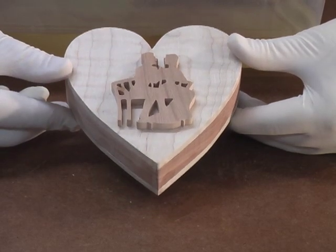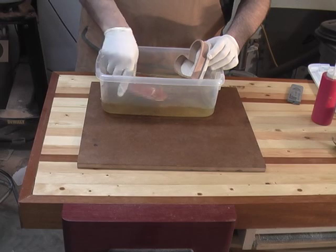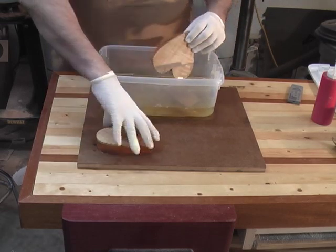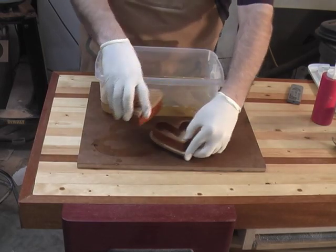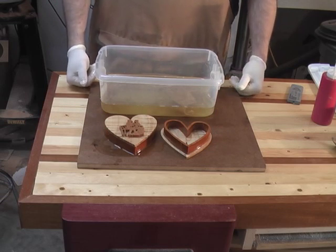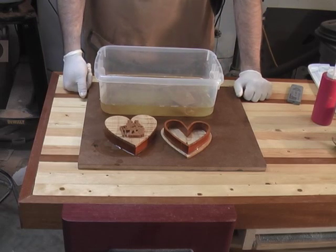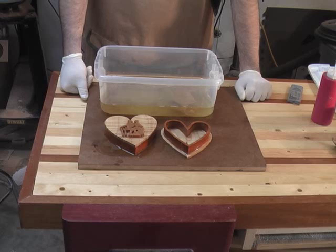Now the last step is I'm going to put a little oil finish on it and then we'll be finished. I'm going to give our little box a dip in the oil finish like you usually see me do here, give it a good coat, and let the top and bottom sit out to drip dry. Once that dries real good, we'll go ahead and put a spray coat of clear lacquer on there and we'll have a nice little box you can give away for Valentine's time. This project was designed to show you from start to finish — from designing the pattern all the way through to the finished project. I hope you've enjoyed this video. If you'd like to see this and other patterns, please join my blog at www.scrollsawworkshop.blogspot.com. I'm Steve Good and we'll see you in the next video.